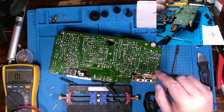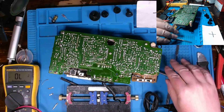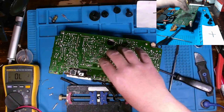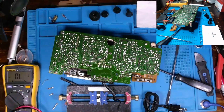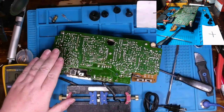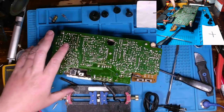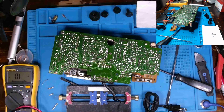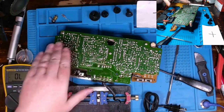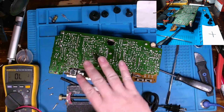But when you have on-off buttons, typically they don't go directly tied anywhere to that regulated DC you developed. They're typically tied to a lower DC line. And so when there's an issue with power up and power cycling, and a lot of electronics that have similar to this, I'm primarily concerned with something that's being regulated further. So a lower DC voltage, if I can put it that way. So that's my assumption at this point.